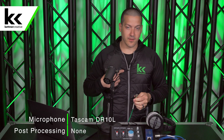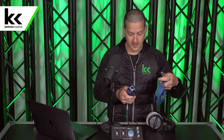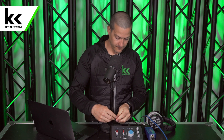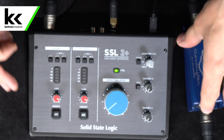So I'm going to plug that in right now so you can see the difference with and without. We're going to connect the microphone to the Cloudlifter, then connect the Cloudlifter inline preamp back into the SSL 2 Plus audio interface. I'll turn phantom power off and turn the gain down. As I turn up the gain on this microphone with the Cloudlifter plugged in, you can see that nothing's happening — the microphone doesn't work and the Cloudlifter does not work with phantom power turned off.